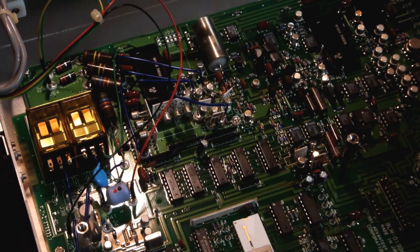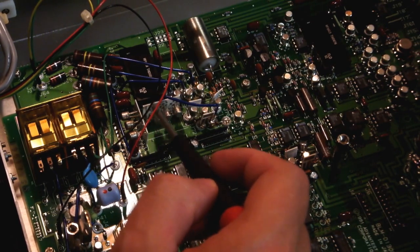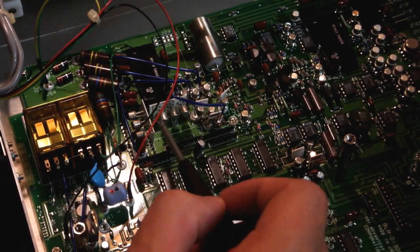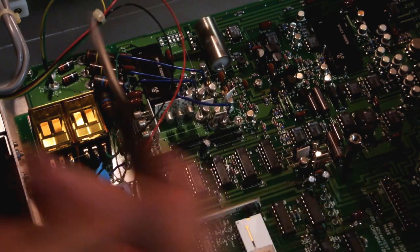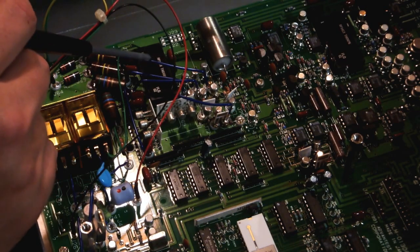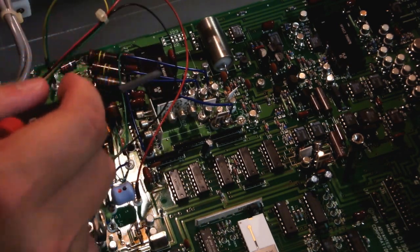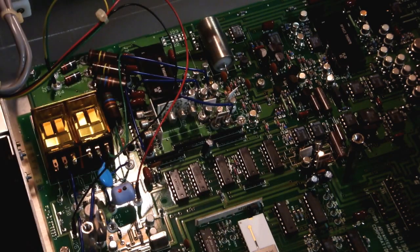Alright, so back to the tripod. Here are those crazy ceramics that we were looking at, and then those amplifier boards on the ceramic substrate. Like I was saying, I think this is probably done for high impedance rather than for board space reasons. I think they easily could have fit these on there. So I think that's for the characteristics of that substrate. We've got another hybrid here. It's very similar to the other one, but it's got a different number, RF9418THD689. So I'm guessing that that's probably something completely different. Maybe an input amplifier or some other digital logic controlling this input section.